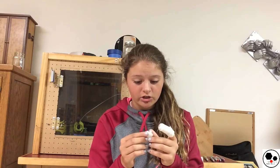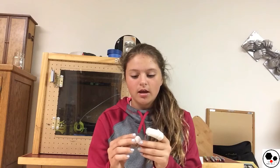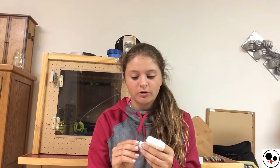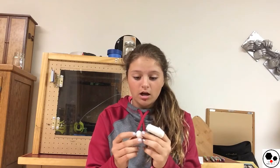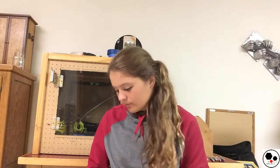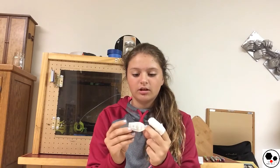Actually the layer adhesion on the Marlin was pretty great. There's no infill on this — I think it's 3 or 4 perimeters — and it's just printed at the normal 60mm per second. This was the best turnout, and I'm going to be attempting to print another Benchy to see how that turns out.